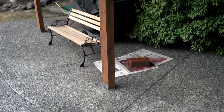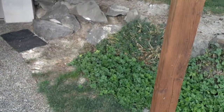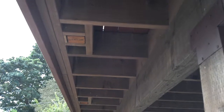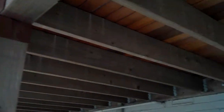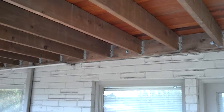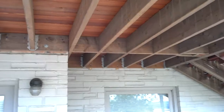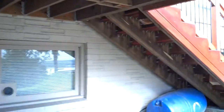Right here on the existing patio we've got some Z-Max brackets and hurricane straps of all different sorts. What we've got under here is the 4x4 handrail posts framed in — we lagged through the rim into that 4x4, framed it in stiffly and stout. The main deck is 2x8s on hangers against a ledger board that we lagged into the rim of the house, 16 inches on center. Where the deck gets a little bit longer off the house, we bumped it up to 12-inch on center spacing.